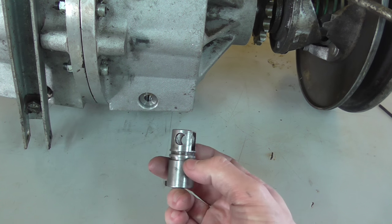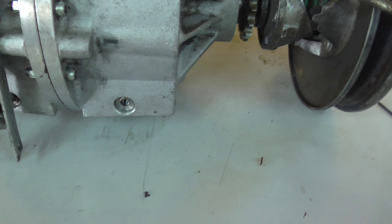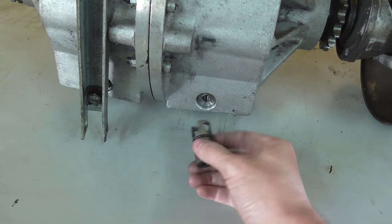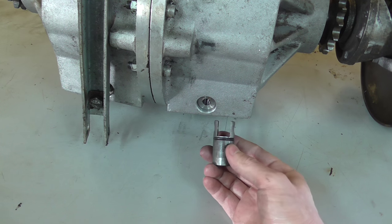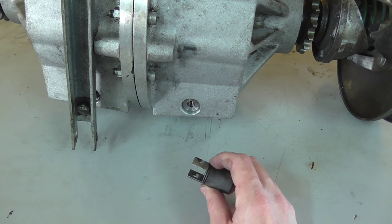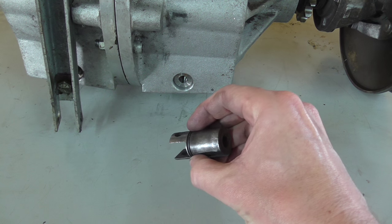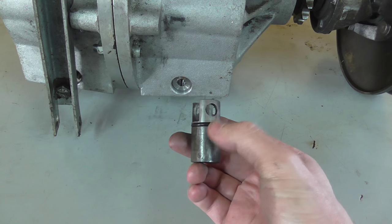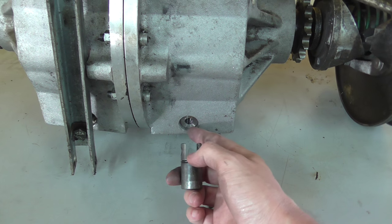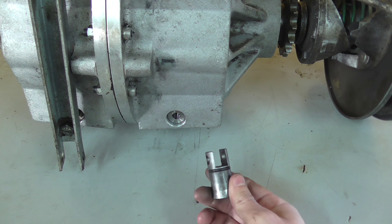It attaches to your drive band, and there you can see a spot for two O-rings. Now some of the older ones, they only had one O-ring on them. So as you can see, down here at the bottom of the transmission, that one O-ring is the only thing keeping the fluid in. So even though it's a small part, that's one of the more important features of a rebuild. Some of these transmissions are over 40 years old. That little O-ring gets dried out, and you get a leak, and there goes all your fluid. So it looks small, but it's really important.